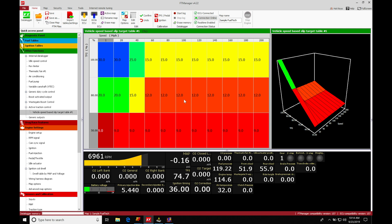Let's take a look at the power shift, or the gear change ignition cut feature, in our Fuel Tech manager software. This is going to allow us to use a strain gauge to have clutchless upshifting or downshifting when utilizing a dog box or sequential style transmission. Setting it up is relatively simple, but there are some details we need to pay attention to so it functions correctly.